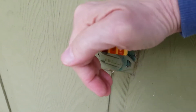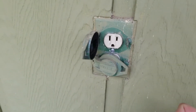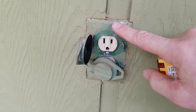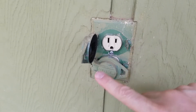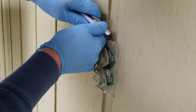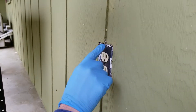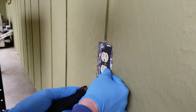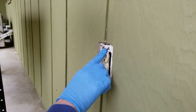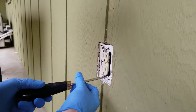With the circuit breaker off, we see that there are no lights, so we know this receptacle has no power coming into it. All we do now is remove that screw, use a utility knife to free the wall plate, and pry off the outlet. We have a gasket in place, which we then remove.